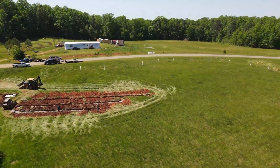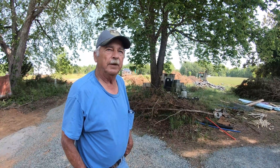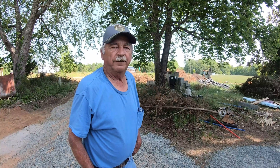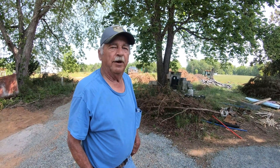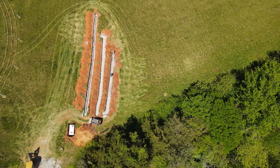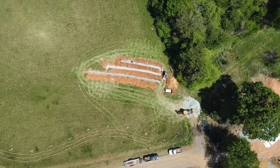There'll be six to eight inches of soil over top of the system — minimum six, but more than likely eight to nine inches. You do not plant any root-invasive trees like willows or anything like that anywhere close to a septic system, and that goes for alternative or gravel systems. I've seen gravel systems 35 to 40 years old and still working fine — it depends on what you put down the sink and how you take care of them.